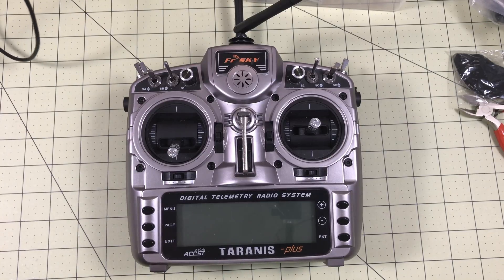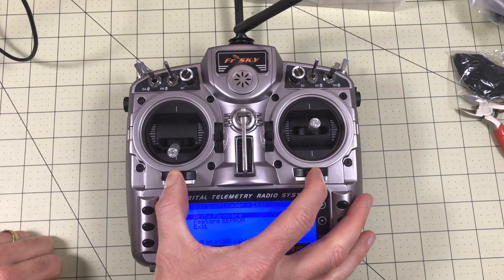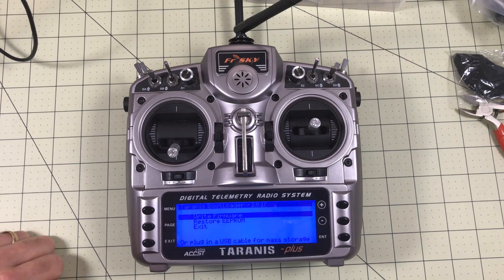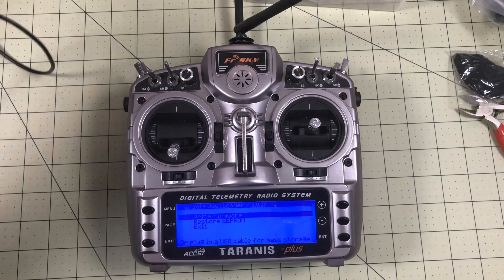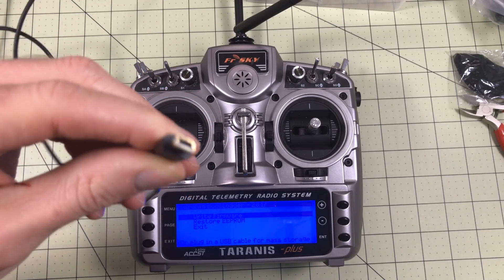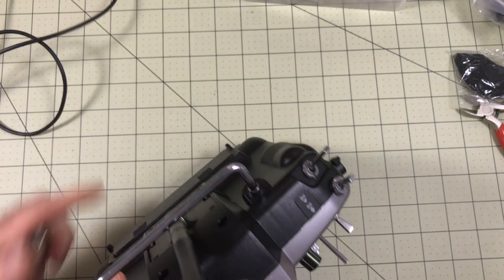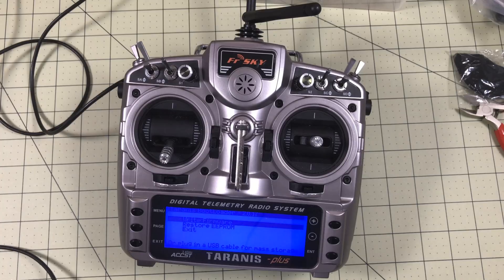Then you need to connect your radio. Pull these pins in and turn it on and you will boot to the bootloader. You need a mini USB cable — not micro like your phone uses, or lightning like your phone uses. It's an old-fashioned mini connector, and you need to connect that and then plug in the USB port.